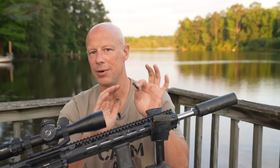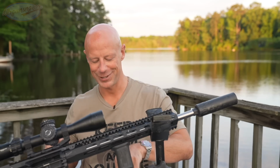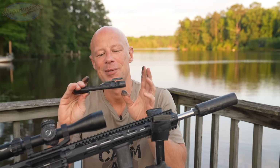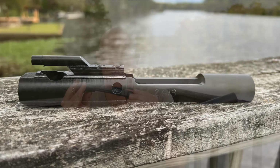Believe me, you can go down a rabbit hole with cam pins, but just say that a standard mil spec one is fine. Let's go with that for the purposes of this video. Next up is going to be our carrier. So the carrier is typically made out of, pretty much every case I know of actually, 8620 steel.